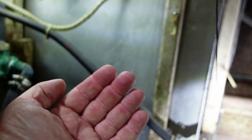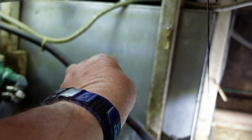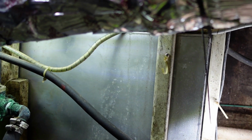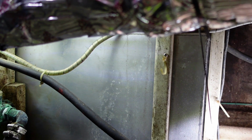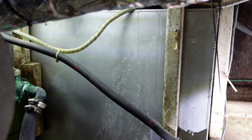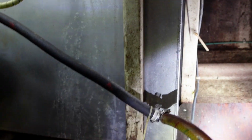It has gaskets on both sides, and it has a stud plate that you cut a 4-inch hole for. The access cover panel is 6 inches, so you have an inch of stick out on either side, and the backside that has the stud in it goes in there, and you pull it through the holes, and then you put another gasket on this side, the cover plate, and then you tighten it down. Doing it that way makes it leak resistant, and that was the best one on the market that I could find. Every tank place that I talked to or researched, they all pretty much use that one if it has to go on the side. Obviously top would be preferred, but I don't have that option.